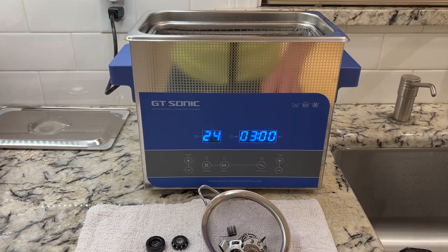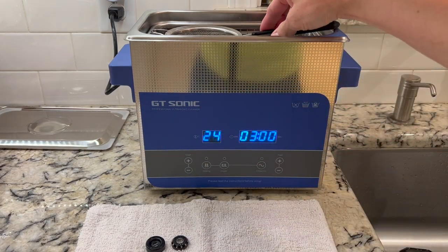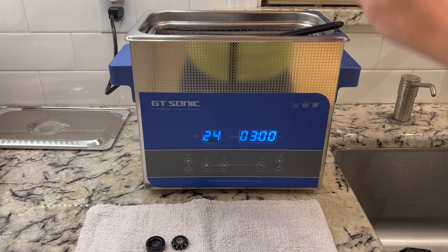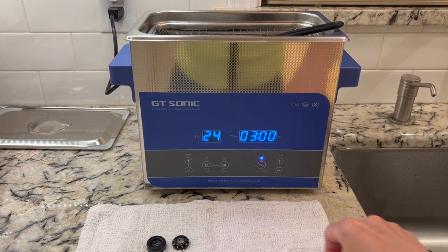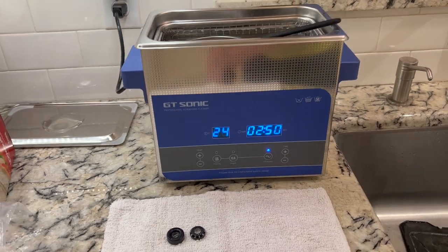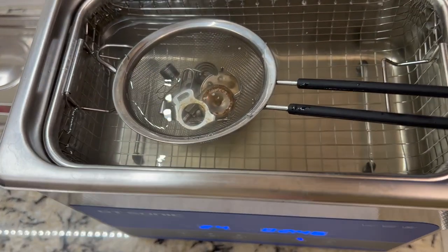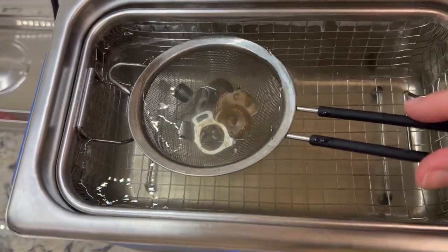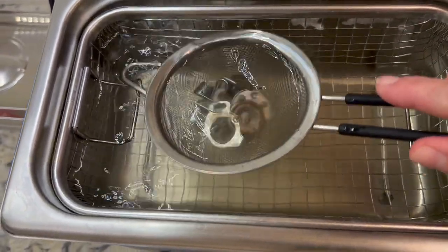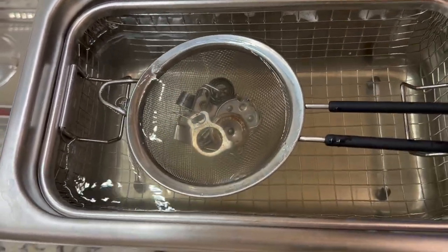The tension unit will go in the ultrasonic, but not the painted parts — they will not tolerate crud cutter or other cleaners, so wash those by hand with dish soap. The other parts are totally fine to ultrasonic clean or soak in crud cutter. I still like to use the strainer even in my ultrasonic cleaner — I just set it down inside and the water vibrates around the parts. You can see the gunk literally coming off the parts into the water. I only run it for three minutes and they are clean.